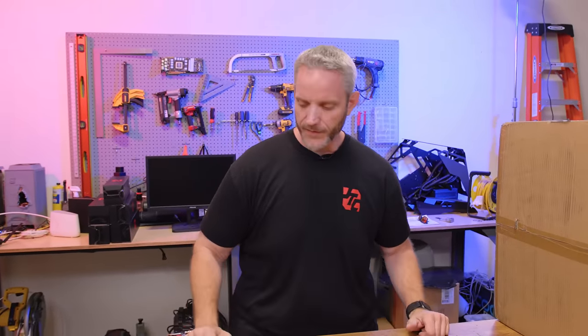I've got our full rack mounted surge protector. I've got our patch panels so that we can finally have all of our Ethernet drops and stuff properly labeled. We're running Cat 6A? Yes, it is sexy cable. We are running Cat 6A everywhere in here so that we can have a full 10 gigabit connection with our switch. We'll probably do a video about that switch anyway, because we're going to switch out the fans so it doesn't sound like a server by itself.